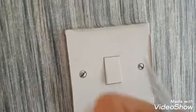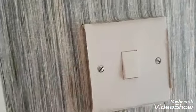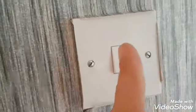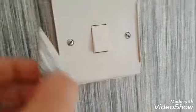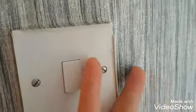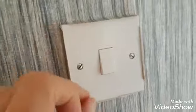and then make a little incision in the middle and cut like an X shape. Always use your scissors — never use a blade. I've seen decorators before that slash and score the socket. Make an X and you'll end up pushing your four corners out like that, so it'll end up looking something like that.